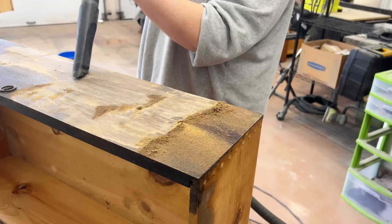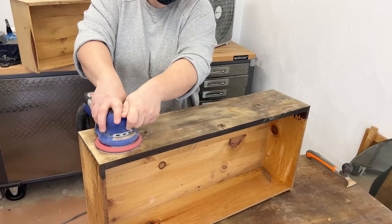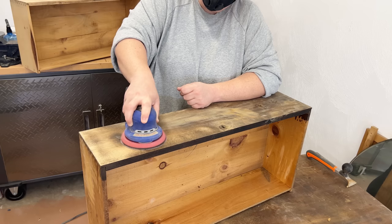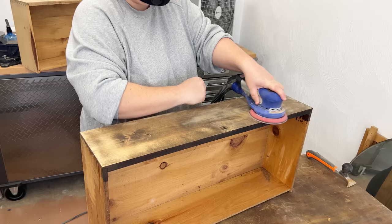and then I decided to try some even more aggressive, like really aggressive, 40 grit sandpaper to remove even more material and see if I could get to some fresh clear wood under this stuff. I would never normally use such a coarse grit because it will, no matter what, create those little pigtail swirlies in the wood and can remove material much more quickly than you realize and end up doing a lot of damage to the surface. But I thought for this, it was worth a shot.